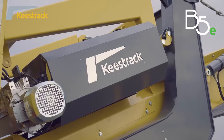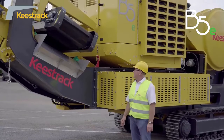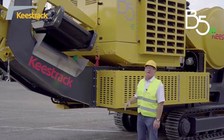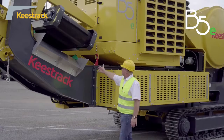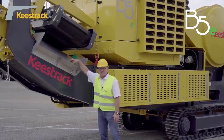The drive of the magnetic separator is done by a gear motor with 4 kilowatt. The belt width is 700 and the axle distance 1800 millimeter. So the magnetic separator is a 3-pole type. It means that on top of the separator no steel parts can stick. The discharge chute is made of stainless steel to avoid also sticking of material here on the chute.